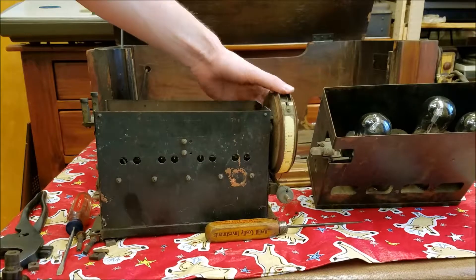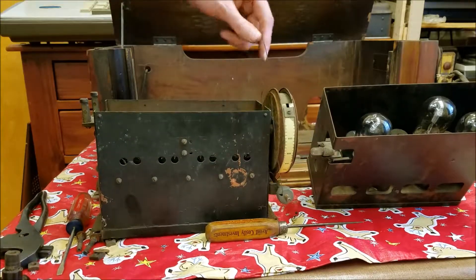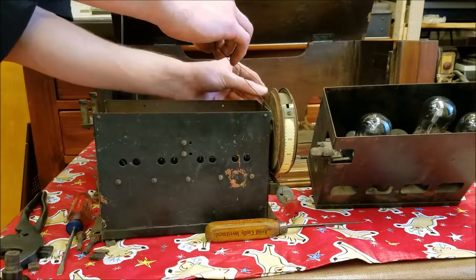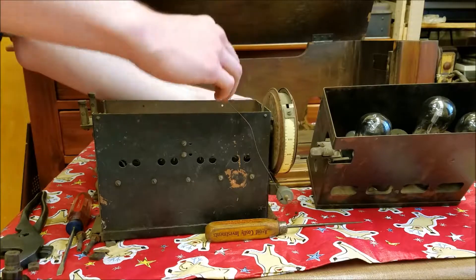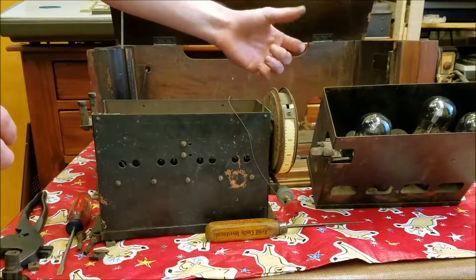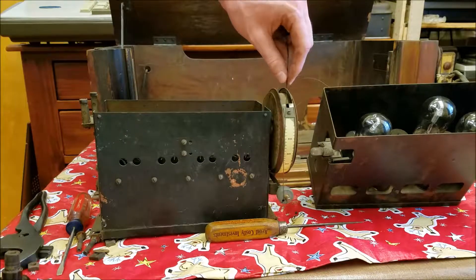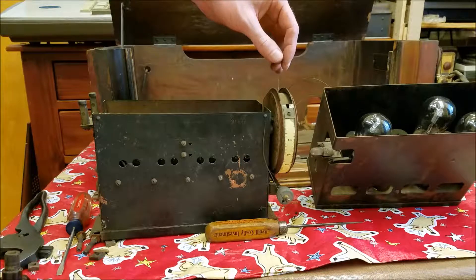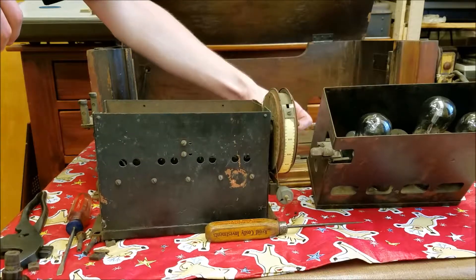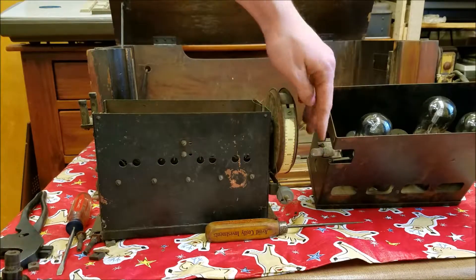We'll have to restring this. This is the first time I've ever seen one of these — actually that's not broken either. I think someone was playing with this because this piece is too short, and there's another whole half of it back here. These are braided wire actually. On the Spartan AC-62 I was working on it had the same thing — that one had failed at the solder connection where they put the cable on. This one actually doesn't seem broken, it's just off its wheels, so I'll have to play with that too. And this little dial light here goes inside when the pieces are together.